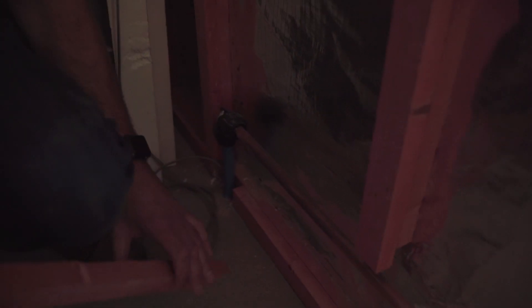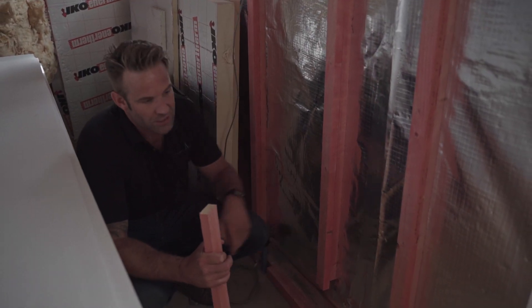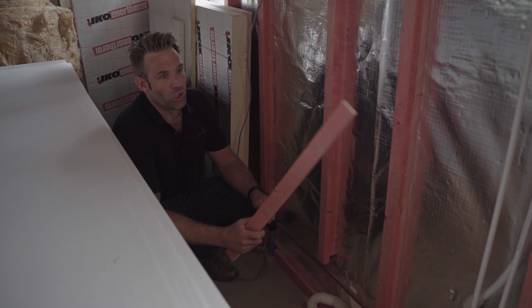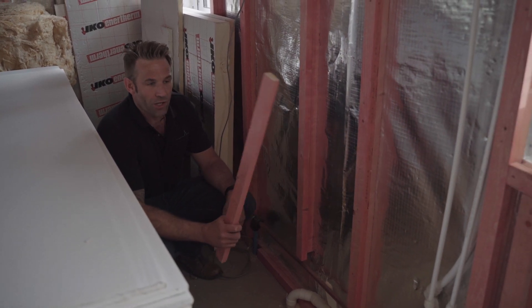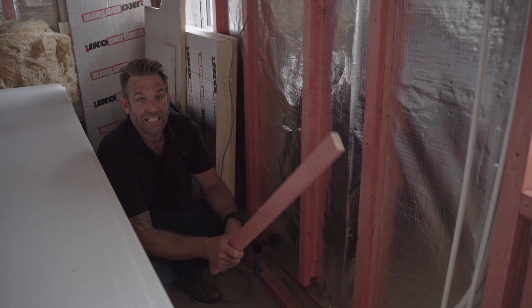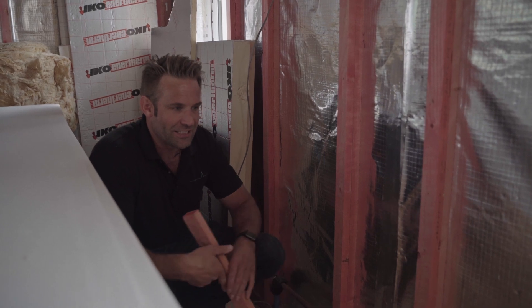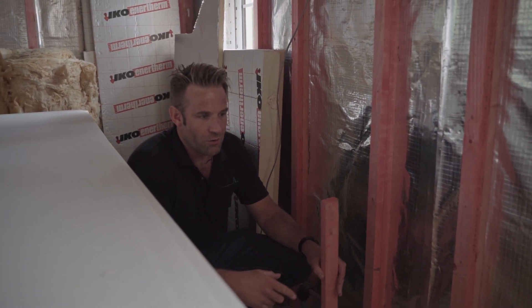You can see where the water's come up — nice and sealed all around here. This will be sealed with silicone. Again, doubled up the batten so the plasterboard can go over the top. So just a quick tip: if you've got any big waste pipes, double up the batten. There is a small consequence in that we have lost 38mm across the whole width of this wall as we don't want to step in the plasterboard. Moving sinks like this has a cost, so really you want to make sure that you've got things in the right place.